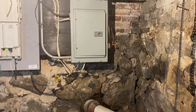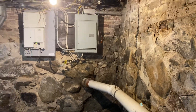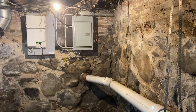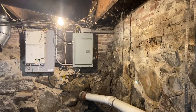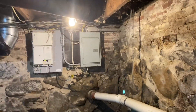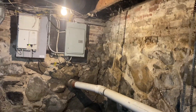Also, there's really no place to stand. We kind of have to straddle this drain or lean right up against it. In any case, the drain is directly in our working space. It's required by NEC 110.26A — it should have at least 3 feet of depth, 30 inches of width, and 6.5 feet of height, but we've got to deal with this drain pipe here.